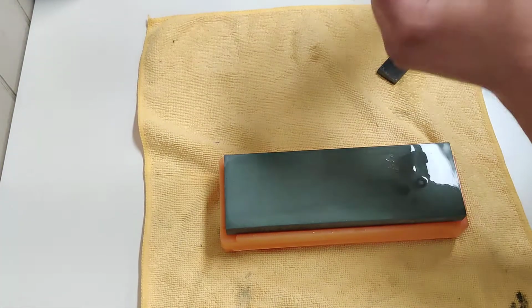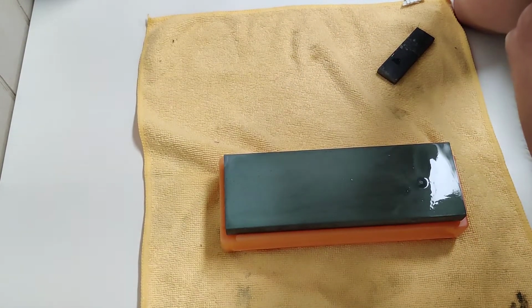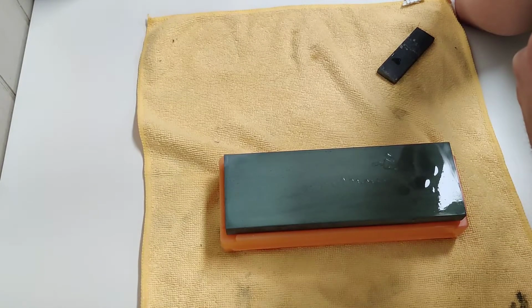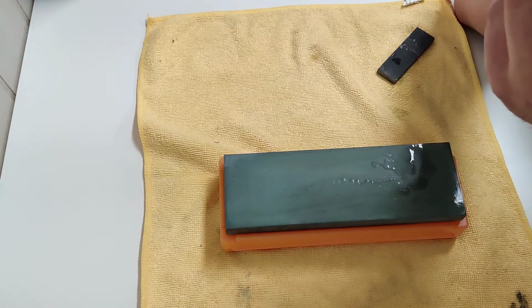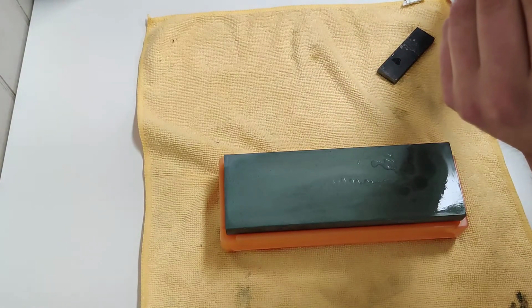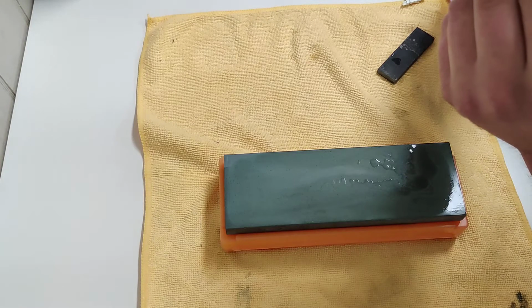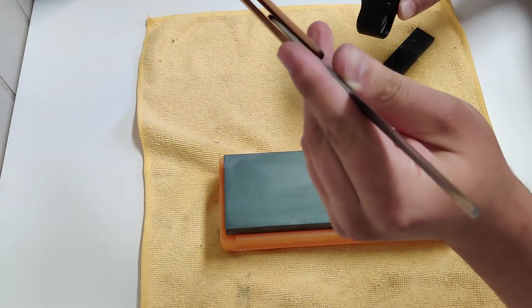Yeah, so we should have no problem right off the bat here. See some nice diagonal X strokes, really, really uniform, really, really fine, across the whole length of the bevel. Just perfect looking. You guys can see that or not, I'm just checking with my loop here. Looking good. No worries there.